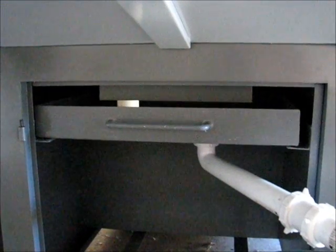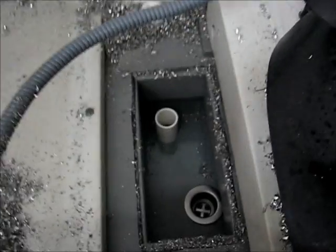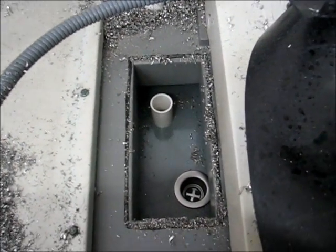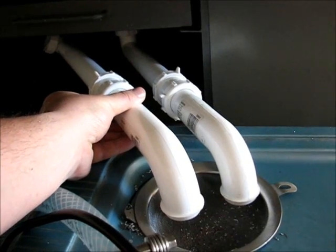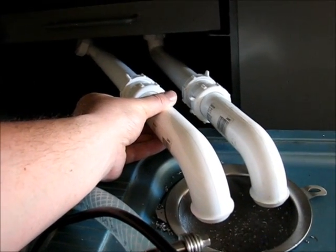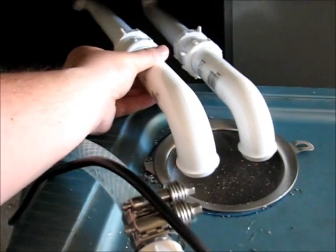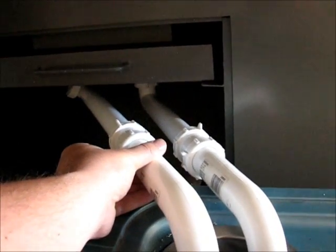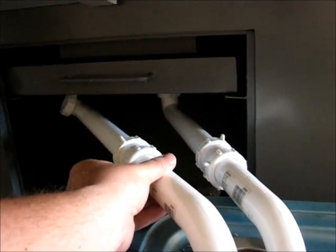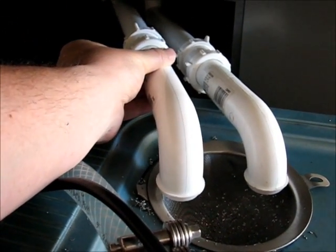I dropped a short section of PVC pipe into the coolant tray from above just to get an idea of where I wanted to drill — that's the spot from above, right about there. I figure I want the second hole to be in the opposite corner of the chip tray. Before drilling I wanted to confirm this would fit as configured. It looks like it will fit without a problem — I just wanted to be sure the components didn't collide, like the two couplers being too close together. This looks good enough, and it'll still fit in the outlet just fine.